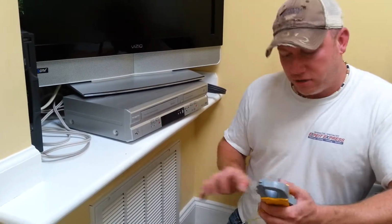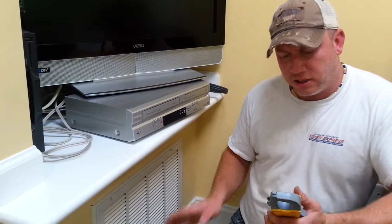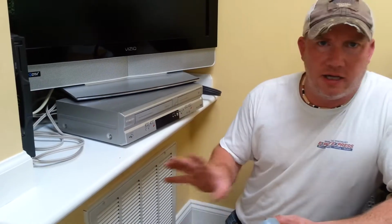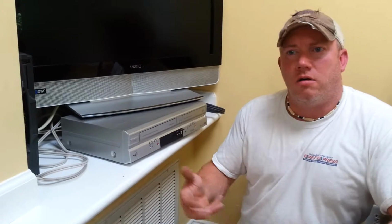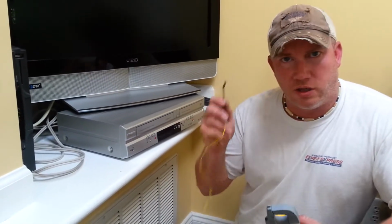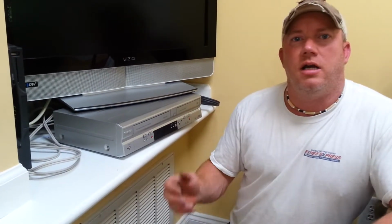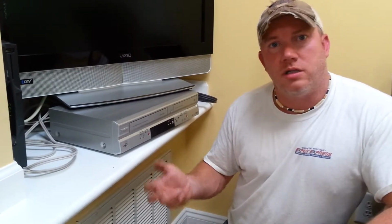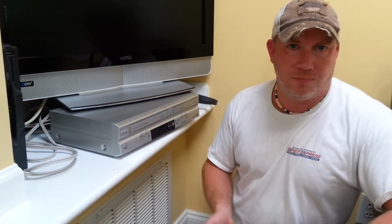So we're going to take the 65.9 wet bulb, and we're going to add that into the Fieldpiece meter. That's going to give us, combined with the outdoor, what we call dry bulb, where we will take temperature without the wet sock. That will give us what we call a dry bulb temperature, and when you combine those, it will give you what we want, our desired superheat. So we're going to go back and enter our data, and we'll be right back.